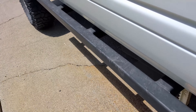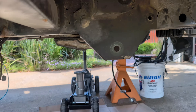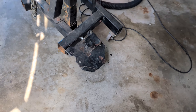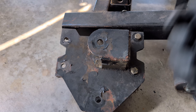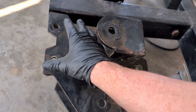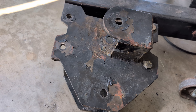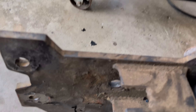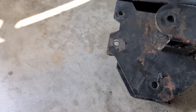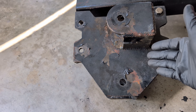I do have the driver's side in the frame right now so I can give you an idea — there's the old bracket bolted up and that's what the new one looks like from this side. Going over that old bracket, this is the same thing I bolted up on the passenger side frame right now, but I've been running these for way too long. It's a pretty simple design — maybe designed by a third grader, who knows — but the main body is three-eighths plate and the lower bracket is quarter inch. I never had any issues, it lasted fine, there's no cracks in the weld, powder coat obviously has gone to hell, but everything else is totally fine. As chintzy as it is, it has this big horrible cutout on the top, but I wanted to design everything new — new axle, new suspension, new steering — and I needed something better on the brackets.